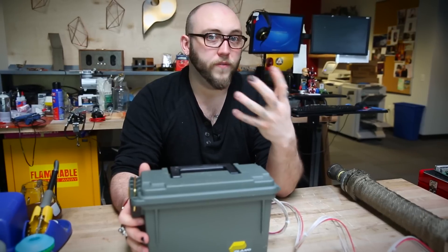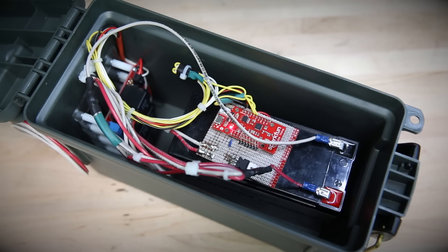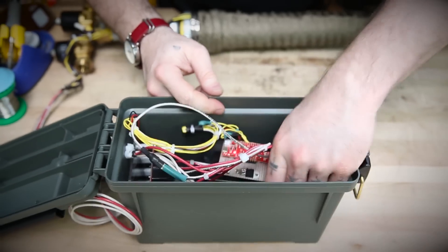and they allow me to control the flow of gas from the end of a standard camp stove propane tank. In order to control both of the solenoids, as well as the silicon nitride igniter, I've connected them all to a bank of relays, which are in turn connected to one of our Thing dev boards. And I've put all of that inside of this plastic ammunition container.